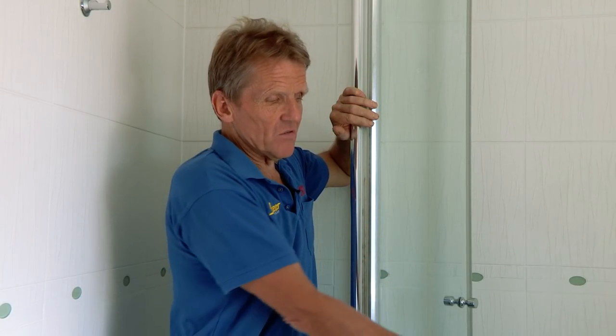But in this case, I can see clearly that this is plasterboard, the cheapest of cheap. Even though this is a lovely house, very expensive, beautiful house, on the face of it, they've used the cheapest component they can. And quite honestly, I wouldn't be surprised if this isn't happening to every single house on this estate. At some time or another, the building's going to move, the cracks are going to open up, and that water is going to get in.